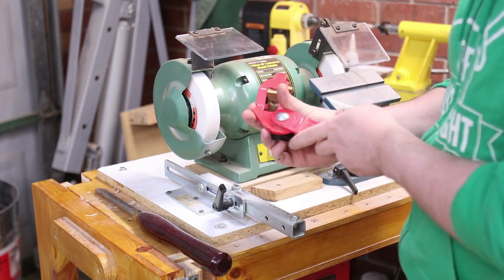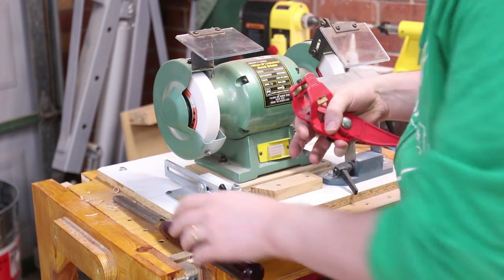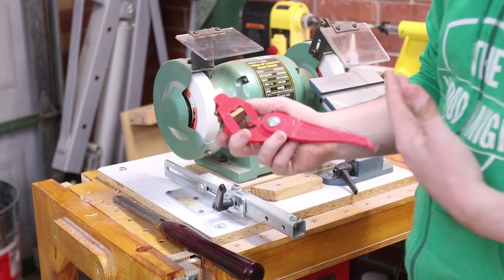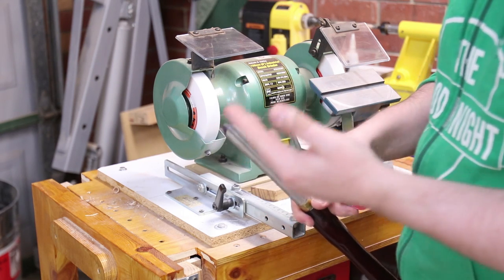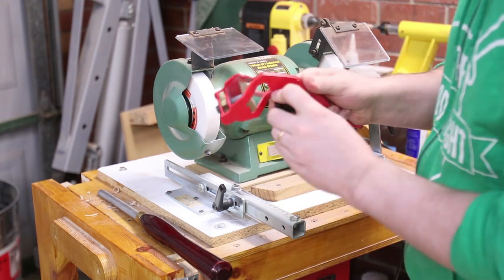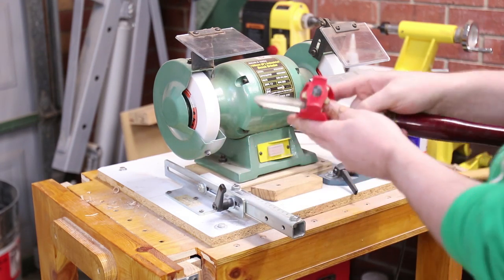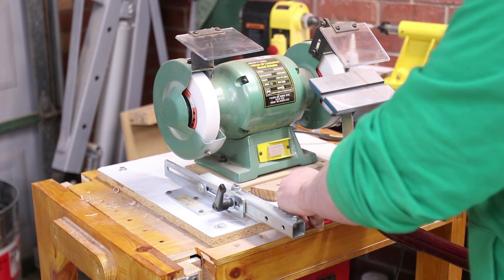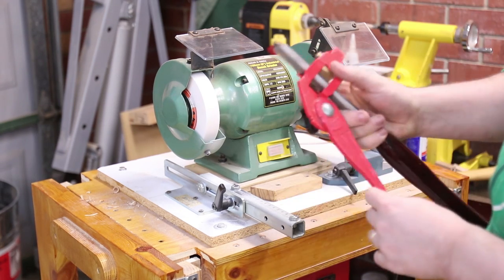On this particular system it has a bunch of numbers which correspond with positions for the leg, and on my particular tool I've written that five is the curve we like to sharpen on. Each jig is going to have something similar, and if you do build your own, put some indexing marks so you can get the same result every time. What we're after is a single facet all the way along our tool rather than lots of different facets, or having to regrind the whole thing every time because we're getting our angle slightly off. Set the jig to five, insert the tool, and most jigs go for two inches or 50 millimeters for the depth of the tool protruding. I've got a block of wood that gives me that exact point every time so I don't have to measure it.